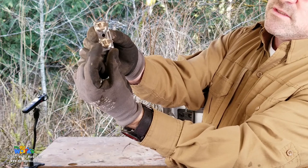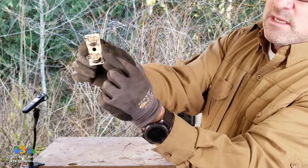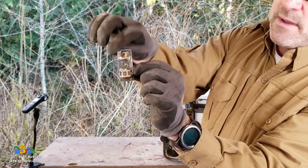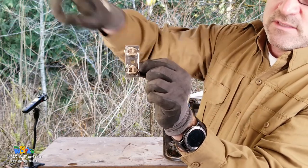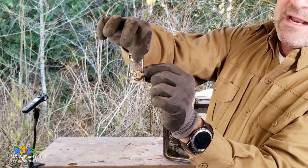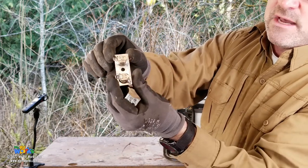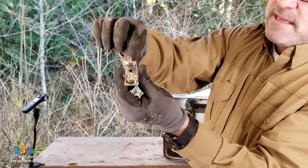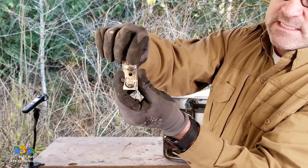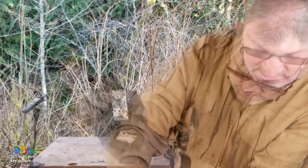So 12 volts enters the circuit here. I'm less than 140 degrees. Therefore, I pass through. And then they have a wire bonded to this side. And I need to go through this one back to this pin to go back to do work. This ECO, energy cutout, emergency cutoff is what we say in the trades, but ECO, energy cutout, is the technical word. It trips at 180 degrees, okay? It does have a reset. The regular thermostat down below does not have a reset. There we go.